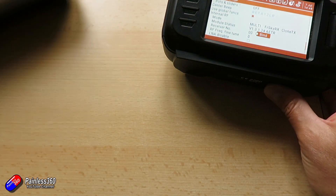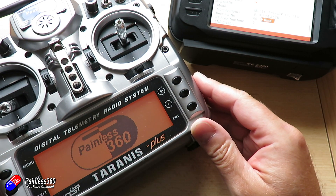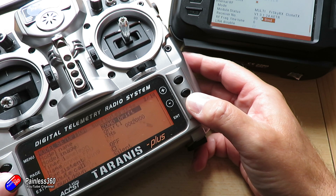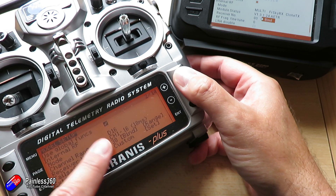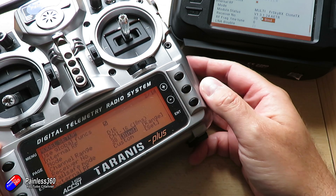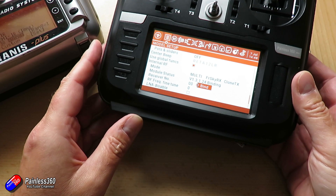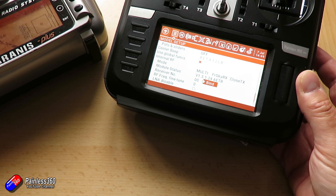Next, we need to power up the radio and pretend like we're going to bind to any receiver. This works in lots of different FrSky modes — D16, D8, whatever — but you have to redo it for each of those modes. I'm only bothered about D16, so I'm just going to go for D16. We can see we are all set. I'm going to start bind and it's going to start beeping. Now that it's binding, I'm going to hit bind on the other radio. What it's doing is pretending to be a FrSky receiver — it's going to hear the radio ID and details and store them on the radio in the D16 cloned bits and pieces.